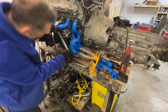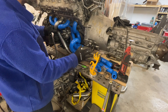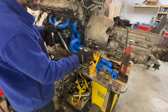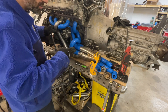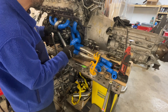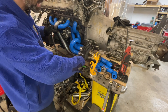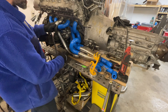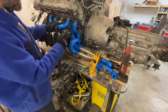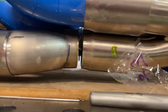Now that I've got it all tacked up and I'm fitting it into the slot, I've determined I want to take the 5-into-1 collector and move it back maybe a half inch to an inch, which will give me a little more space to make straights that go into the slip joints. You can't go directly from a curve into the collector — it needs a straight section so there's enough material to meet in the middle. This is really looking good with no interferences, and now I can start working on the next tube. That just about wraps up the video — we got our first tube done, and the other tubes are coming in the next video. Thanks for watching, and don't forget to subscribe!